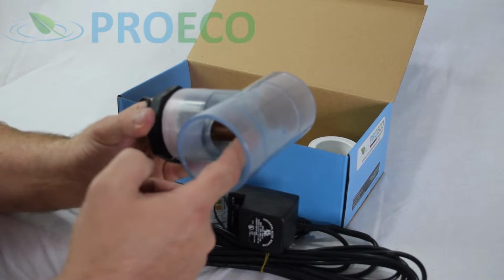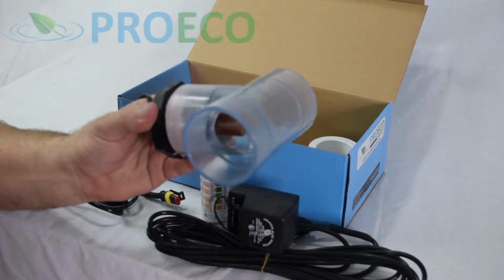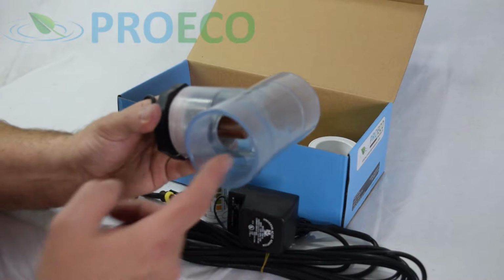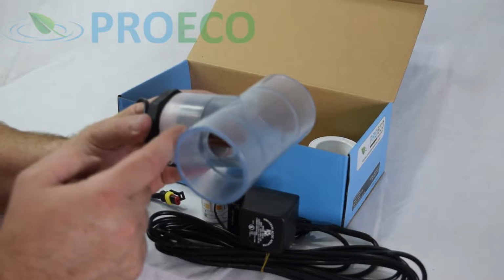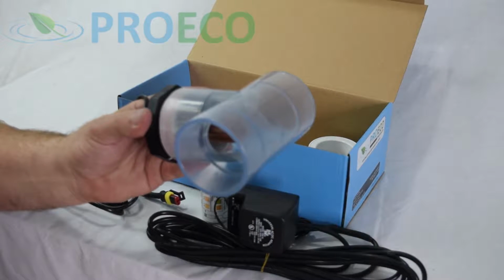As this is operating, these anodes will begin to decrease. So typically you want to check this once a year, definitely every 2 years, because once they get down to where you almost have nothing left, you need to replace the anodes at that point.